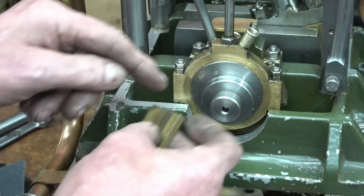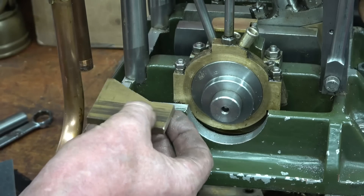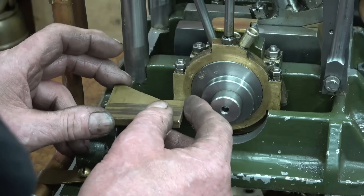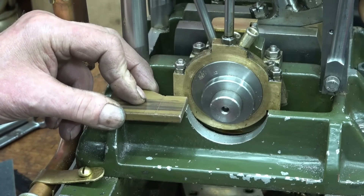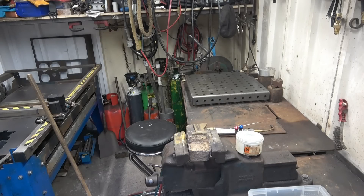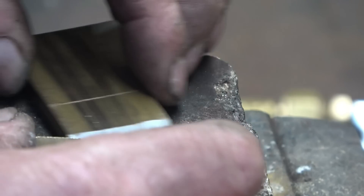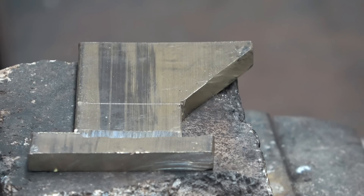All I'm going to do is extend that - I'll cut a piece of brass off and silver solder it onto the end of there, then remake it. I could have just made another one and said nothing, but that's not what it's about. Mistakes are made and we'll sort it out. I've got a piece of brass on a fire brick with a little chamfer on - the solder will run through there, no problem at all. It's oxypropane - once the flame stabilises and you've got it, it's pretty good. I'm going for a dull red to melt the silver solder.